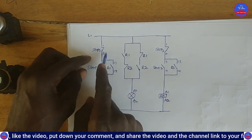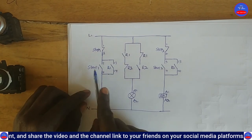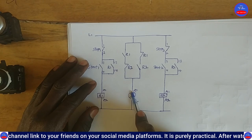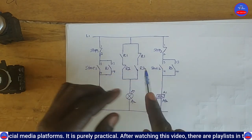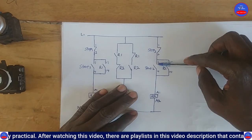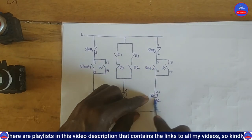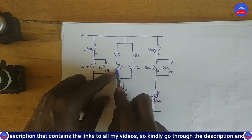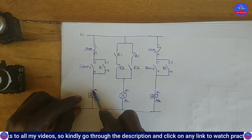When you want to turn off the bulb, you press Stop Button 1 and the bulb goes off. Now, assuming you pressed Start Button 1 and the bulb is on, you can equally use Start Button 2 to turn the bulb off. This is because current is present on this side, and the moment you press Start Button 2, Relay R2 energizes and this contact opens, so the bulb goes off - while Relay R1 is still energized.